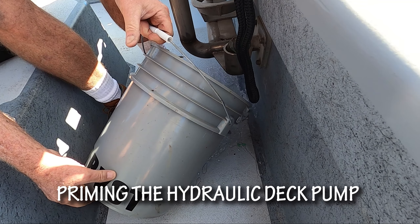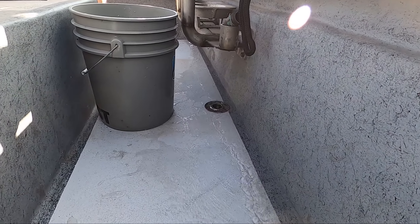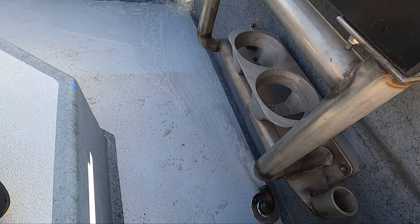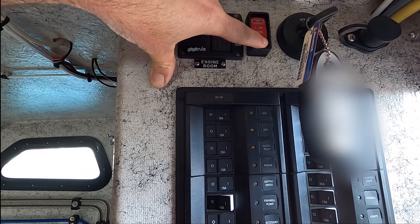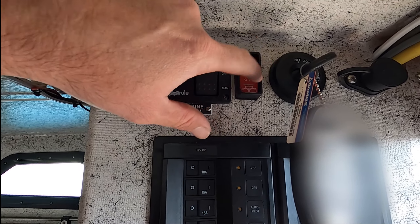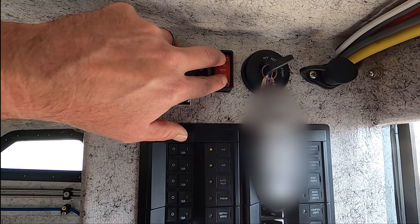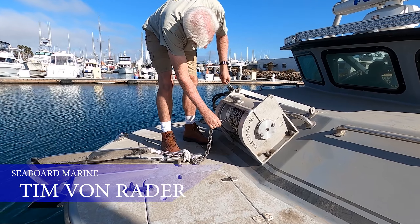The hydraulic powered jet pump. There it goes — that's forward. We're going to turn on forward now. This is the deck pump switch. When you go in reverse, we don't want to burn up the impeller. So if you hit reverse, you have to also hit this deck pump reverse button, which latches a relay on, and then it'll go in reverse. When you go back to forward or off, the relay unlatches, and anytime you go to reverse you have to hit the button again. We added this.